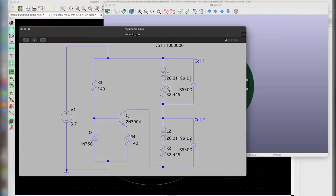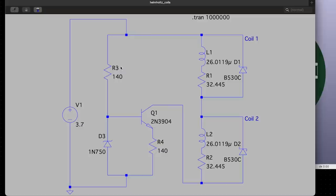Let's take a look at the very simple current driver circuit to drive our coils in the snow globe. This is a Zener voltage stabilizer. We've got our voltage source, which is our 3.7V battery. Then we create a voltage divider between resistor R3 and our Zener diode D3. The voltage drop across the Zener is kept constant due to its properties when reverse biased, which is also going to be the voltage drop across R4. The constant voltage drop, therefore constant current running through R4, will be the same current running through the collector of our BJT transistor. I've got our coils modeled as L1R1 for coil 1 and L2R2 for coil 2. Then our two Schottky diodes are our flyback diodes — so when we remove power, the collapsing field that creates a reverse current doesn't damage the rest of our circuit or our battery.